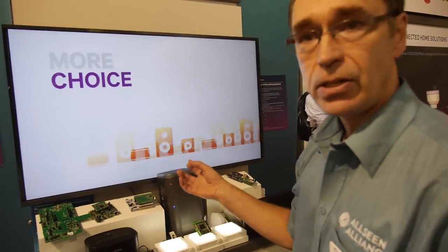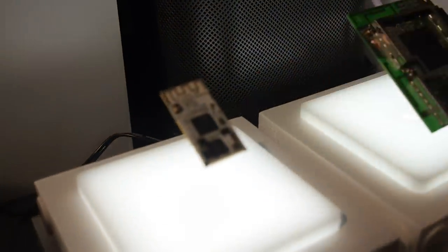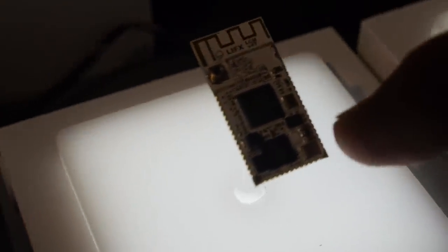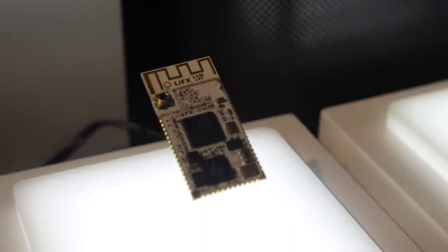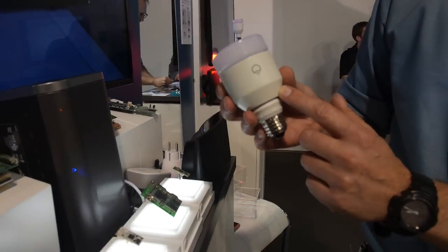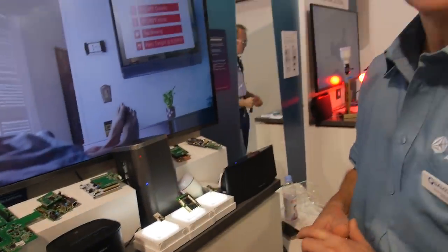It's meant for embedded applications, low power solutions. For instance, it's used in this solution over here, which is a turnkey module for lighting that we co-developed with LIFX. The 4002 is paired with the Freescale microcontroller, we add a PWM to the board, and so this particular board can power an LED lamp. These lights over here actually have this board inside — it's a Wi-Fi LED lamp. These are on the market today, sold by LIFX.